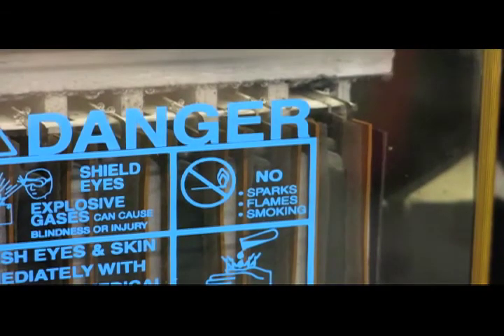If we look closely at the separator in this cell, we'll see that there's actually a piece of glass fiber mat placed between the separator and the positive plate. This is called a retainer mat. Not all cells have retainer mats; however, the job of the retainer mat is to retain the active material in the positive plates.